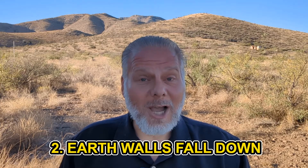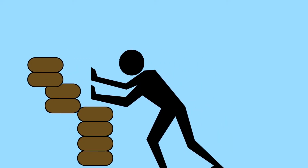The second hidden drawback is that these buildings fall down a lot. We don't see it that much — if somebody is making a YouTube video about earth bag and it falls down, they usually just stop making the video. It takes a really brave person to show their failures. It's just soil: it has a lot of compressive strength, and straight up and down it can support a lot of weight, but it can be pulled apart pretty easily and it's not very strong at all with sideways loads. That's why most people build in buttresses or build in a curved arc instead of a straight wall.